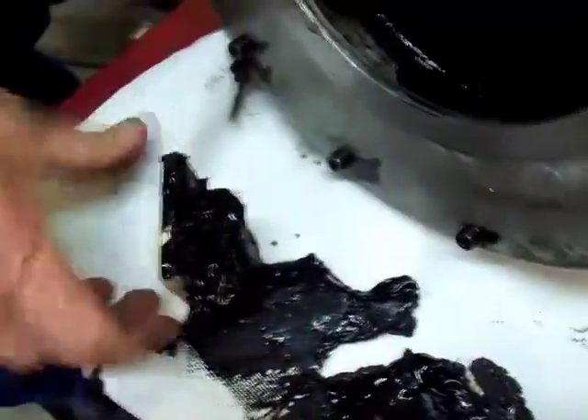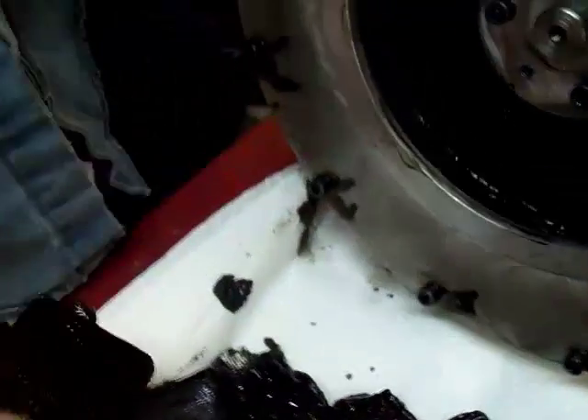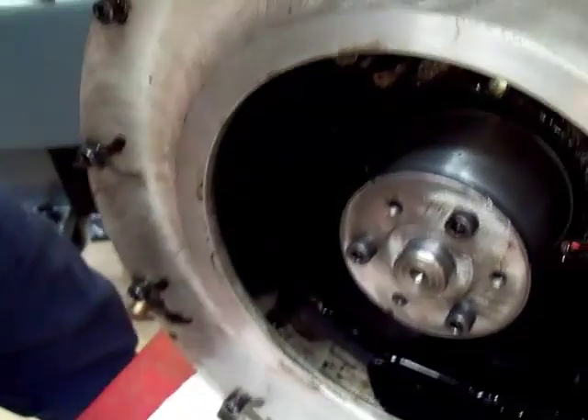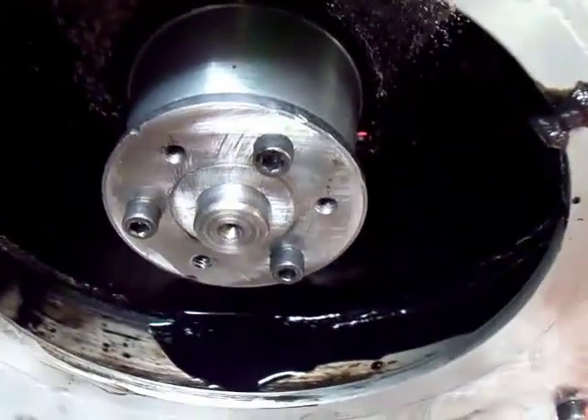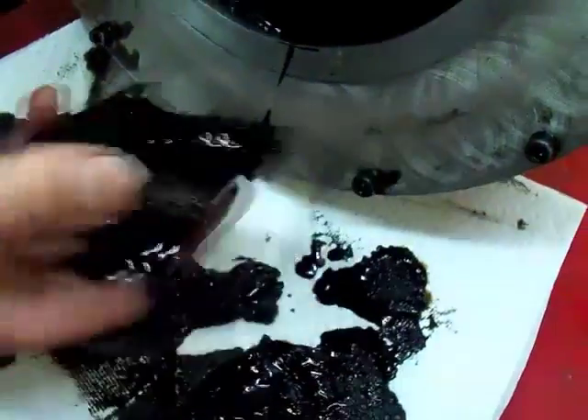These are the solid particulates. Remember that you also get a thick sludge — we've probably taken out five gallons of thick sludge, and this is the hard, hard goop that sticks out too. So that's a lot of goop out of oil that's already been through a 10 micron filter. You can see we've got plenty of it, and I can keep on scraping and get plenty more.